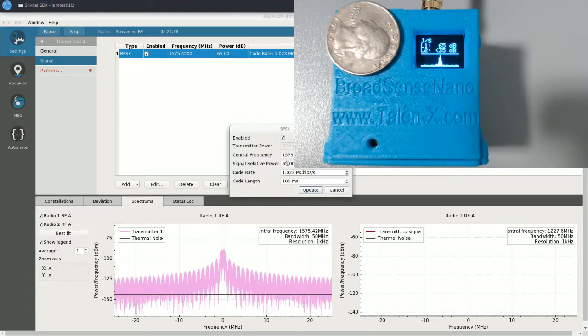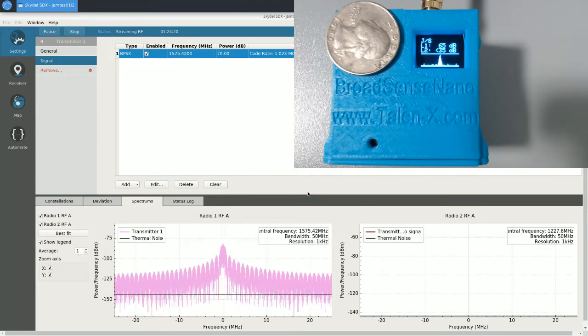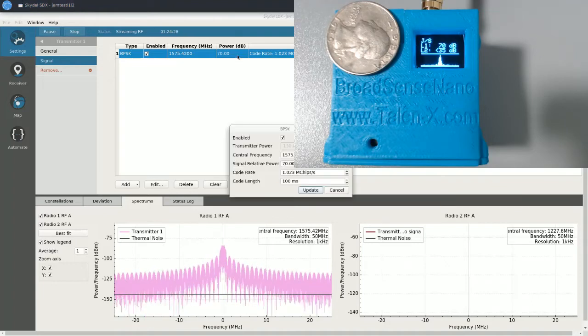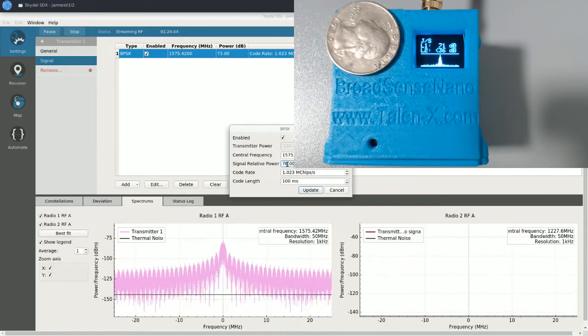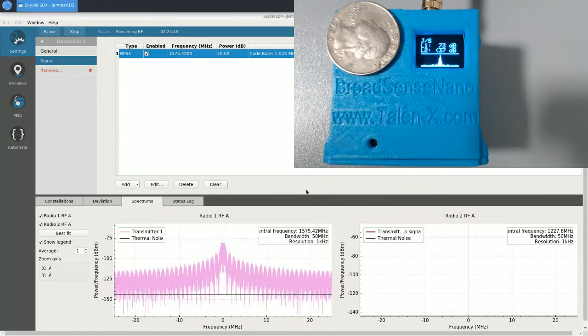Let's try 70 dB. Now we are actually approaching the more difficult part of the curve. 70 dB is quite a bit of jamming and the sensor struggles a little bit more in this region. So I'm going to go up by increments of 3 dB and show you the effects. You can see at 73 dB we actually underestimate the jamming by a couple more dB than we have been before. Let's go to 76 dB — you can see that we're undershooting the jamming by about 3 or 4 dB right now. This is the weakest point on our jamming curve.